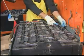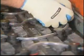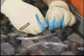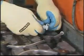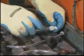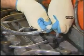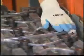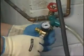Connect the quick disconnect coupling, splitting the two series of either 6, 9, or 12 cells. Install terminators to the caps at the end of the series. The Fill Watch system is now ready to fill the battery cells with water.